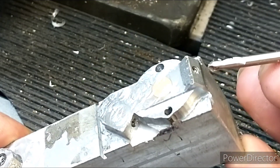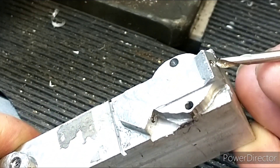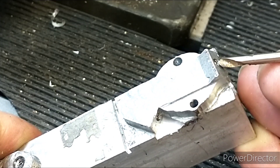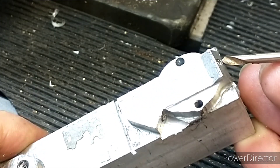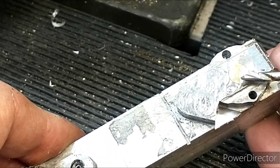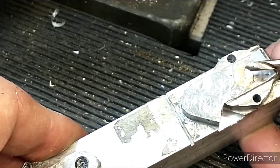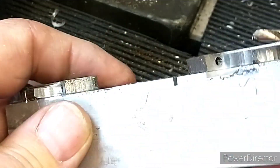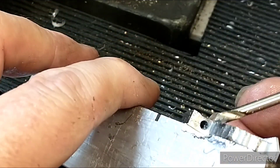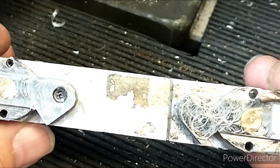The oil holes are drilled. I started off with 2.5mm and then did 1.5mm for the very last part. Having a brass pin here actually really helps because you can see the chips change colour when you get into the brass, so you know you've drilled deep enough. We've obviously got the hole there as well. So that's all the lubrication points done.